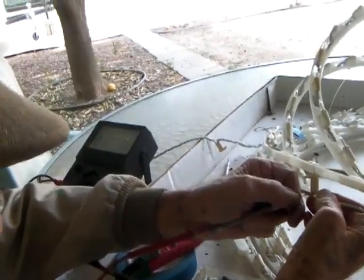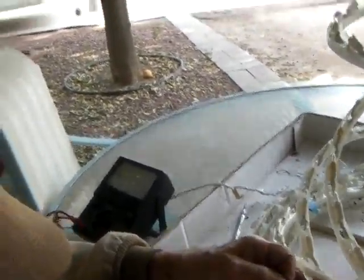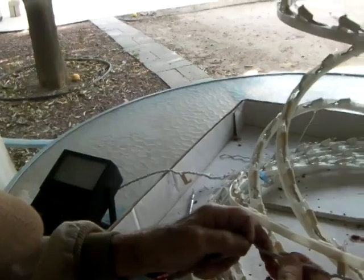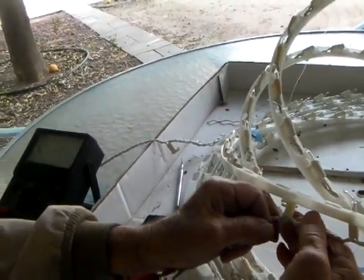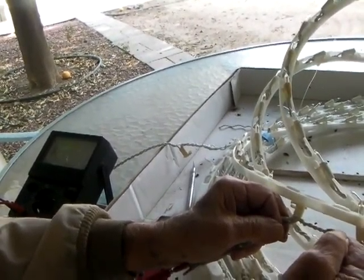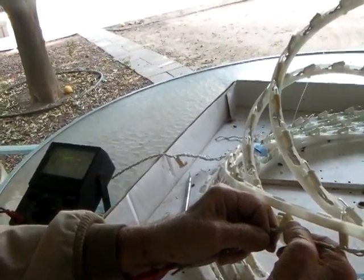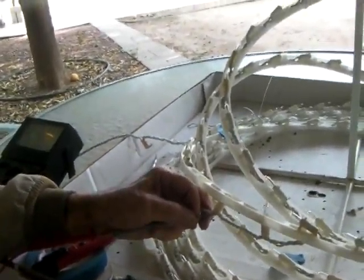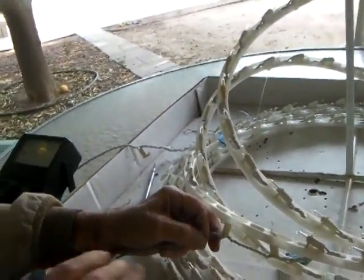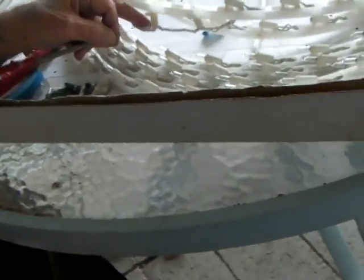And then we got one more wire, which is right back up in. You can see it. There it is, way back in there. Which means that the hot wire comes up, goes through the bulb, and comes out of this wire here. But this happens to be a ground, the same as this ground, or neutral. And that's how they're getting the three strings. Some way or another, they're carrying the ground.